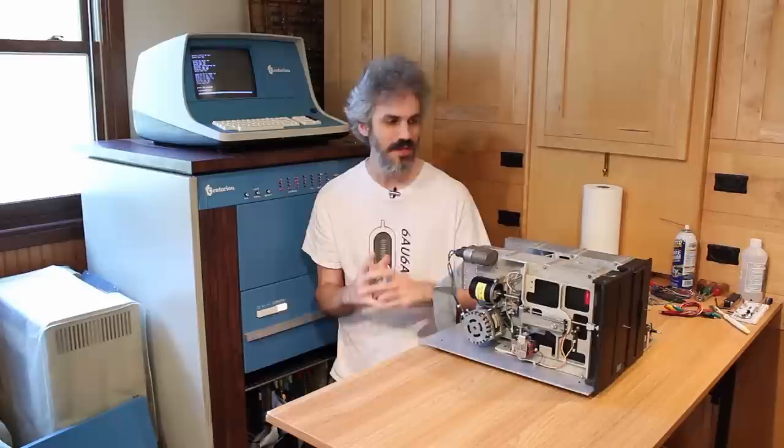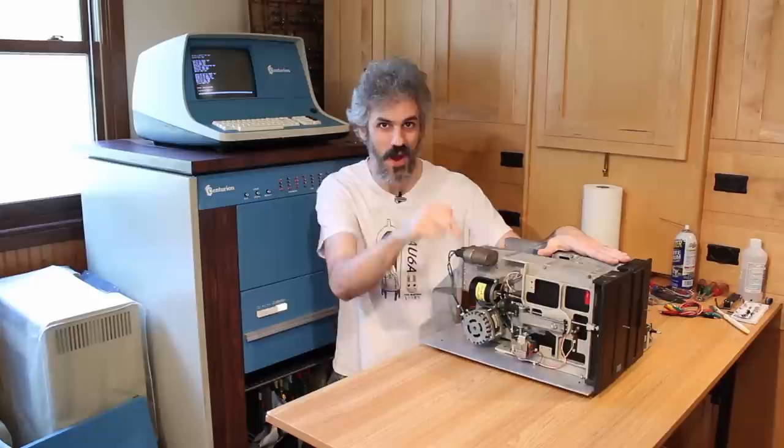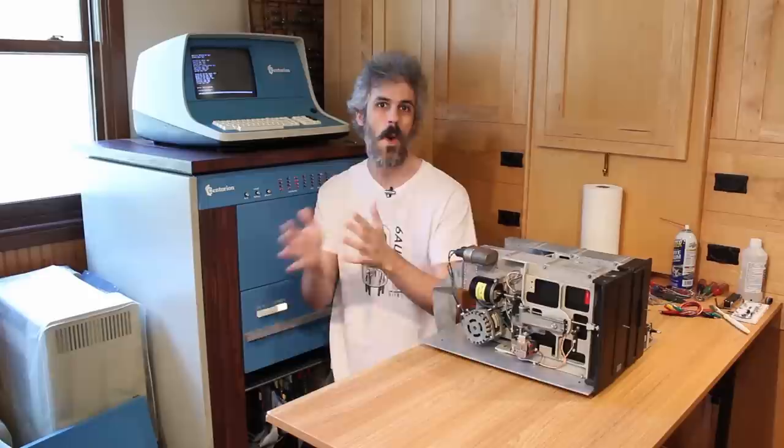So my plan is to focus on drive A, get the FFC repaired, and write something to drive A, then use that disc to align drive B. They won't be aligned to anything else out in the world, but I have never seen any data for a Centurion on a floppy disk anyways, so I'm not really too worried about that. But they will be aligned to each other, which means I should be able to swap data between the two.